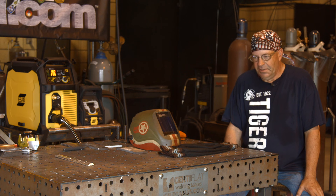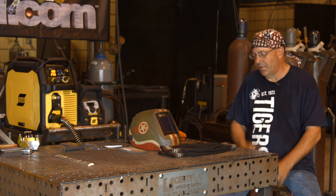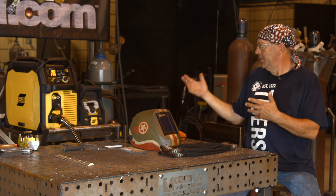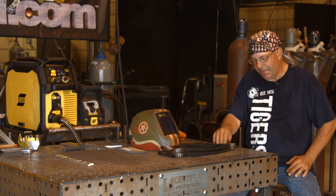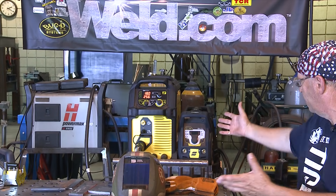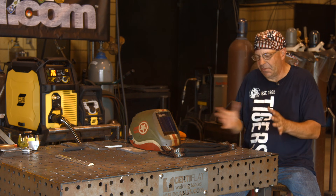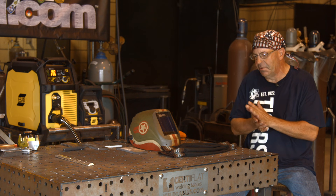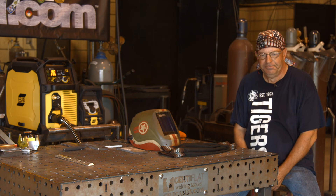The question was: do you ever just weld with pure argon? I know people want to just get by with one gas only. Well, if you're doing some fabrication around the house with one of these small machines, you can do a lot of different things with them. We've got a bottle of C25 and a small bottle of pure argon because we do short arc, globular, spool gun aluminum, and TIG with those two gases. The original question was, can you just do all your welding with pure argon? My answer is no — if you like undercut and stuff like that, then you might want to try it. But I want to show you what happens.